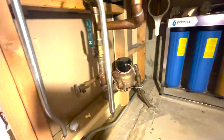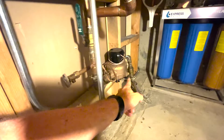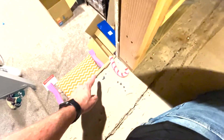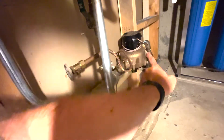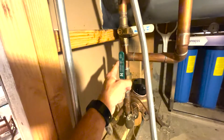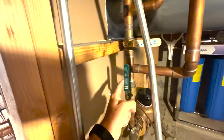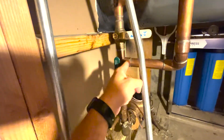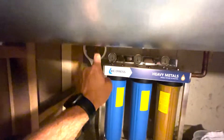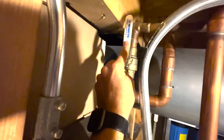I did have a plumber come in, and you could say this is pretty elaborate. I'm in a crawl space, so my water meter and everything — this is some of the shoddiest plumbing work I've ever seen. What they did was we have a shutoff valve to the house right here. What this ends up doing is rerouting itself all the way back to the filters. So the water gets redirected through the filters, back up through this pipe, and it comes right back into the house. So anything that uses water here goes through this system.